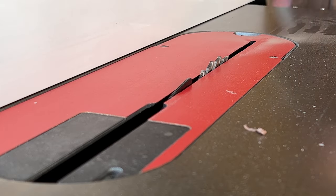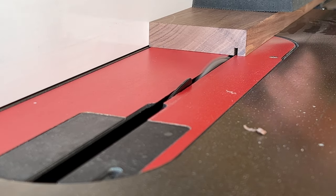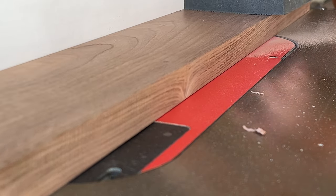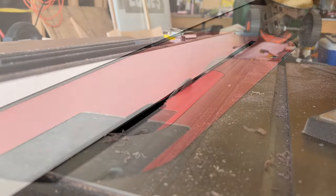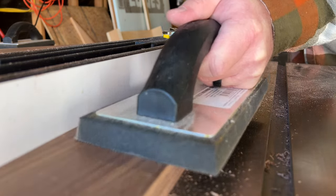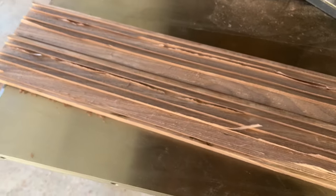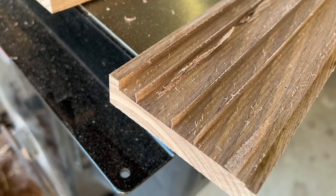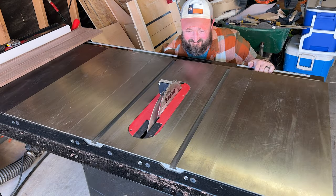Because I didn't have a dado blade at the time, I basically ripped this dado on these pieces one pass at a time. It took forever. I would move the fence over slightly each time — I thought it was a little too sketchy to stand it up and raise the blade all the way, so I just took my time and repeated this cut over and over. This is what I was left with: a little half-inch lip that's going to be the front face, and I cleaned up the mess off camera with a chisel and sandpaper.